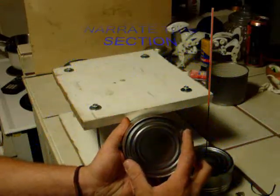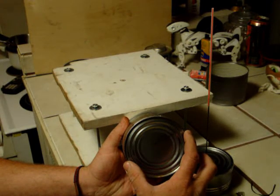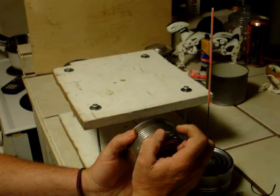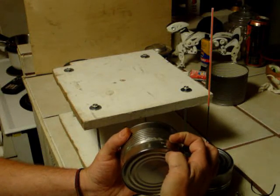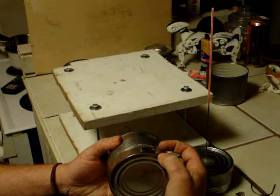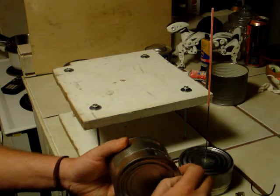The inside width of the main chamber is four and one eighth inches, or 10.4775 centimeters. Divided by two for radius, that equals two and one sixteenth inches radius, or 5.23875 centimeters radius. Pi r squared gives us 13.364 square inches, or 86.2 square centimeters of area to heat the air inside. This is why we don't want a four-inch-high main chamber — we'd have two inches of air to heat. One inch, or 2.54 centimeters, will do just fine: 13.364 cubic inches of air, or 218 cubic centimeters.